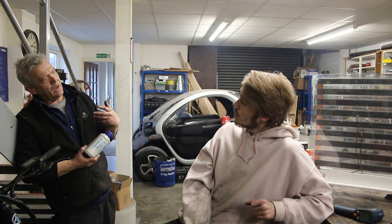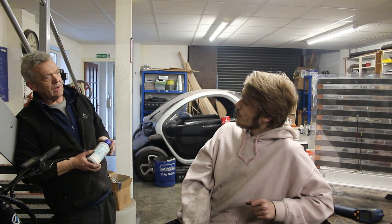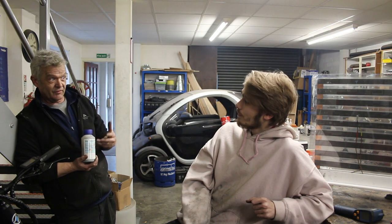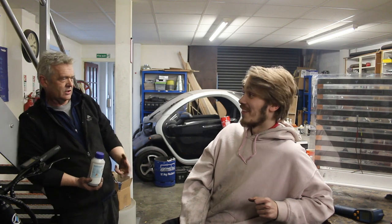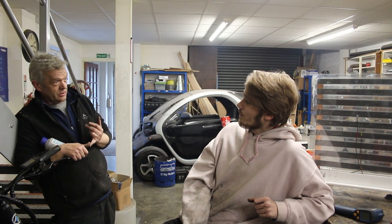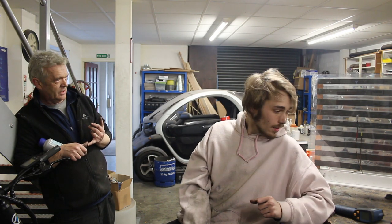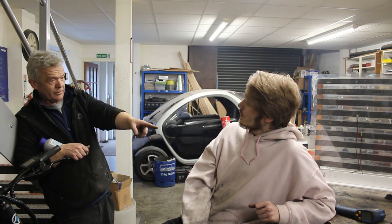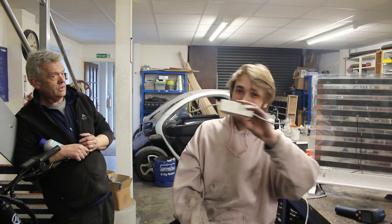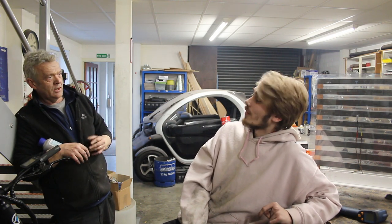Okay. So if you're trying to make a heating element out of our conductive ink, because our conductive ink is so conductive, you need to do several things. You can use a transformer. So if you plug it into the mains, you can use a 24 volt transformer. And then you'd be able to do a little panel, just like that one there. You could stick a transformer on it and hold the voltage down, and the little panel like that would work just fine.